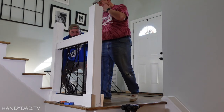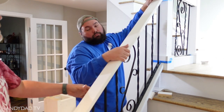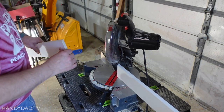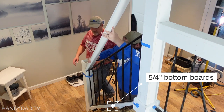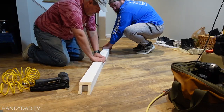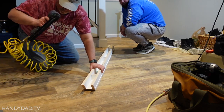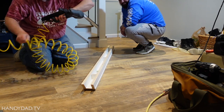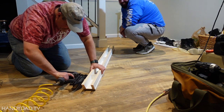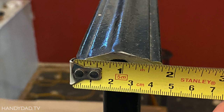The tops of the railings were capped with the same three-piece design as the bottoms. We marked the top pieces in place to get the exact length and angle. We couldn't use the same three-piece design for the bottom rails going up the steps, so we used 1x4 by 5-quarter boards — 5-quarter is a little bit chunkier than the 3/4-inch boards used everywhere else. We assembled the top rails with three 1x4s using spacer blocks that purposely gave a little overhang.